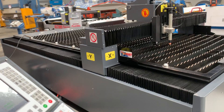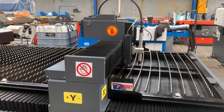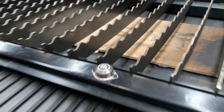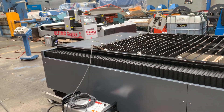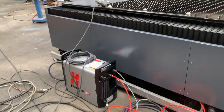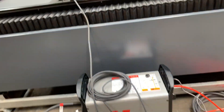Let's walk around the machine and show you the basics. We've got the X and Y axis there — you can see the heavy, heavy duty build quality. Look at the thickness of those slats on the bed. We've also got the cantilever on the side where it runs back and forth. Being a water table, we don't want any water damage on bearings or any exposed metal, so that's all covered in. We've currently commissioned this machine with a Hypertherm 105 plasma power source — American-made.